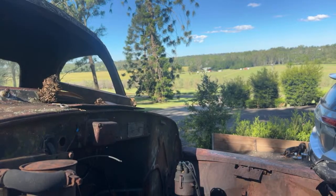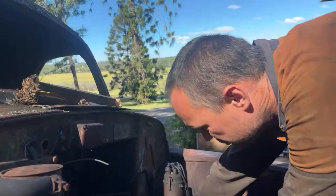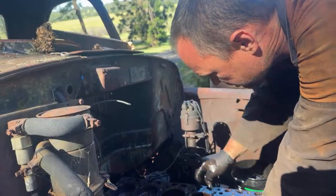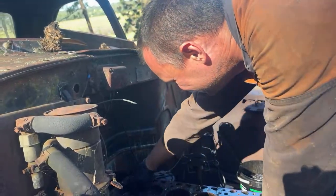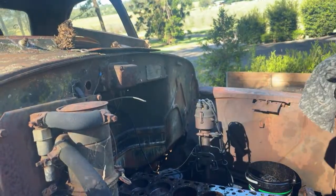I don't think the back one needs cleaning up. I think it's only that number 4 there, third one. It's got that rust ring. I think the rest should come up past them. I'll probably give them a bit of a scuff. I'll go and get a bit of paper and just give it a light rub, just so it doesn't hurt the rings any more than they are.